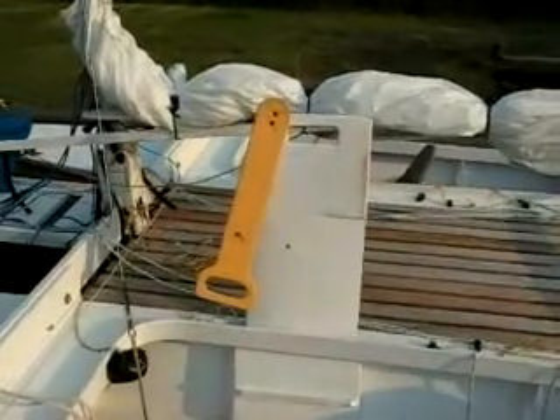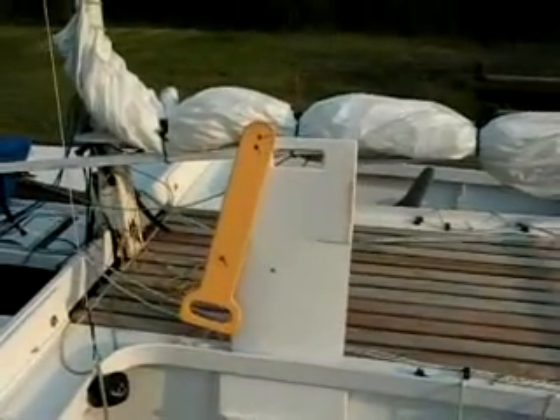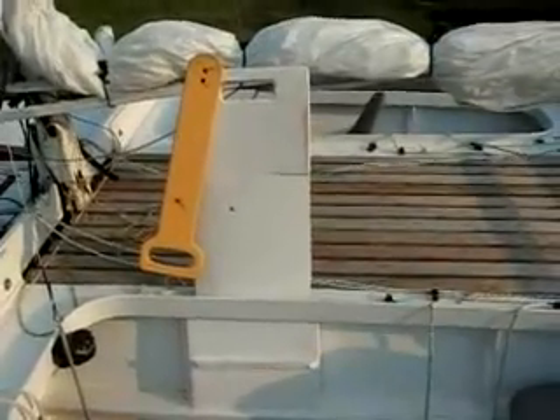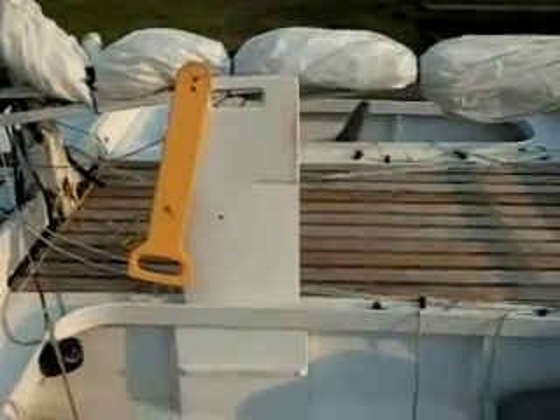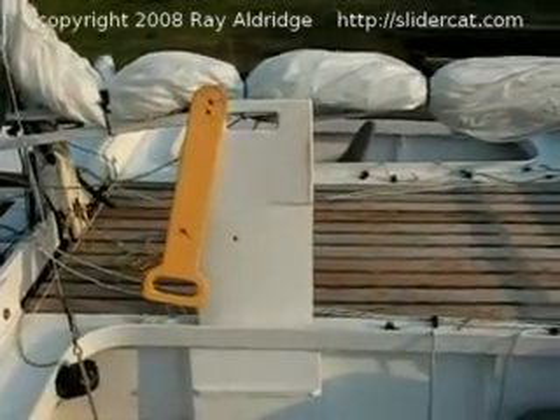This is the dagger board. Right now it's pinned at the second position, which gets it completely out of the water — it's not anti-fouled, so I like to keep it out of the water. That first pin hole below the handle is for when you want the bottom of the dagger board to be even with the bottom of the hull. I've moved the handle around — it's just a Dyneema lanyard going to the three-quarter inch plywood handle. The reason it's designed this way is because if it were a solid one-piece dagger board, it would stick up so far when raised that it would endanger the boom as it swings from side to side. It also creates a lot less clutter on deck even when the dagger board is down.